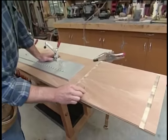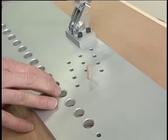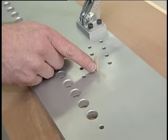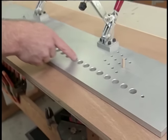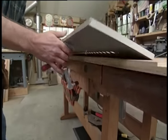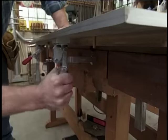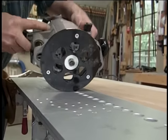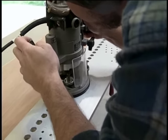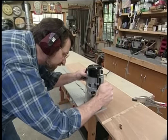With one of the side pieces clamped in the workbench, I'm ready to make some holes for the adjustable shelf pins. I'm using this jig. There's a series of small holes into which a pin goes that sets the distance from the edge of the sheet to the center of the holes, and then there are holes one inch on center which will guide my router. Now I slide the piece and the pin against the edge of the sheet and lock it down with these clamps. The router is set up with a collar that fits exactly into the larger holes. When I plunge the router down, the quarter inch router bit will drill the hole for the pin. All the holes will be equally spaced and in a line.